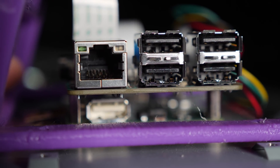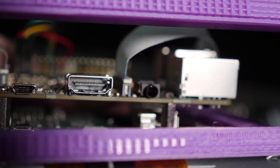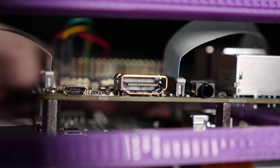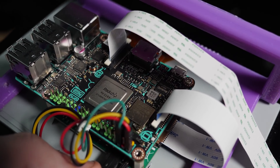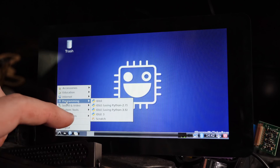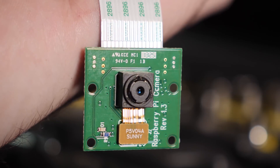It's a little bit limited by the microSD slot read — I was able to do that speed from a RAM disk, but with an appropriate SD card you probably could get there. It has four USB ports, one analog 3.5-millimeter audio jack, and one full-size HDMI port. It supports 4K at HDMI 1.4, 4K 30 Hz. It has the 40-pin header that's basically the same pinout as a Raspberry Pi, so you can use a lot of Raspberry Pi devices. I used the touch LCD and the camera, and I was able to get both working.